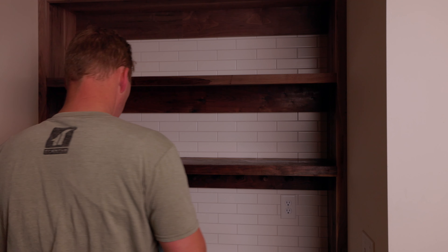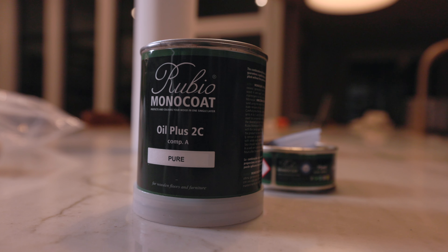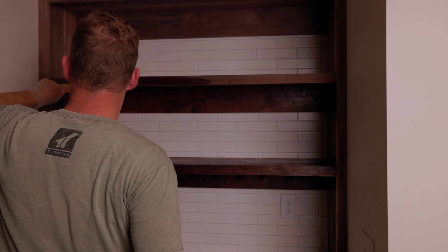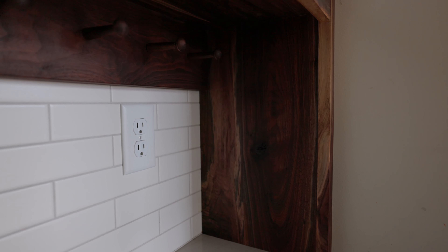We're halfway through applying the oil finish. One of my favorite parts of these wood builds, especially with walnut, is the finishing coat I put on. I'm using Rubio Monocoat - the same thing I used on the countertop in the pantry - and I love it because it really brings out the awesome natural color of the walnut and gives it a good sheen without being too glossy. The shelving unit is all finished and the coating is dry. I love the matte finish and all the natural variation in walnut - you get tones from light to dark and it looks so cool.